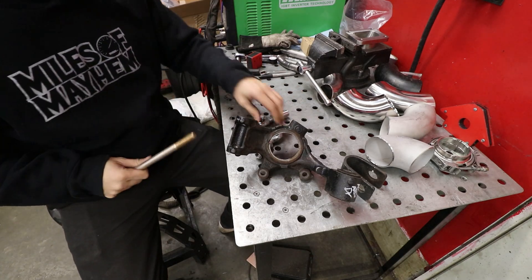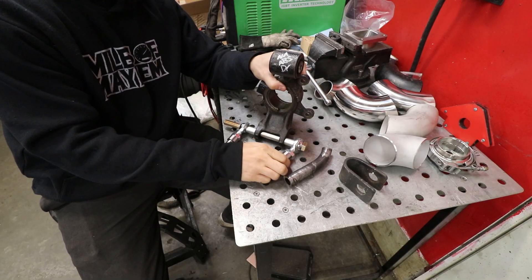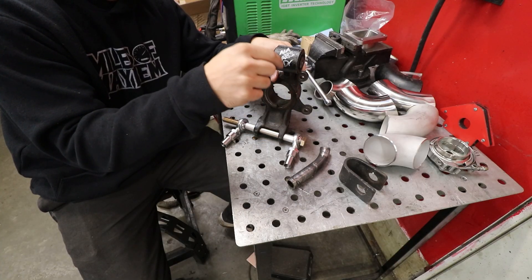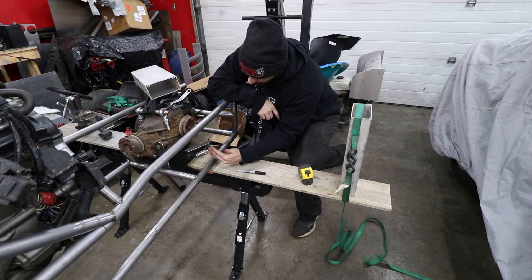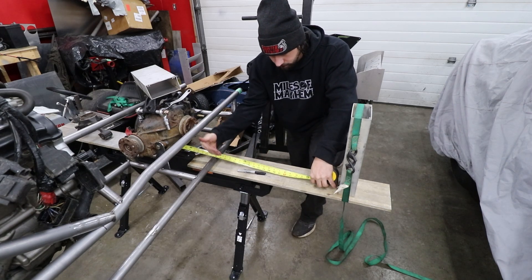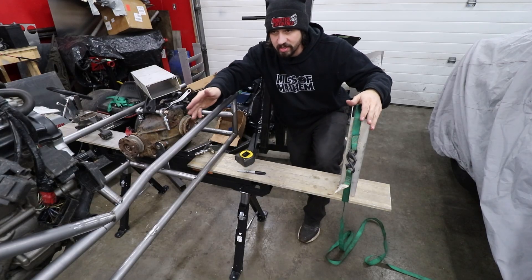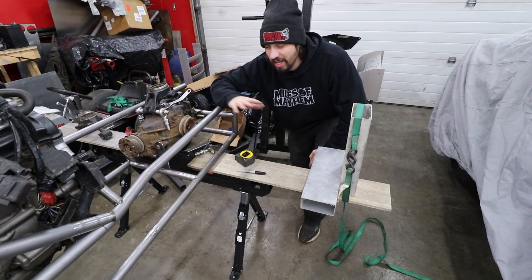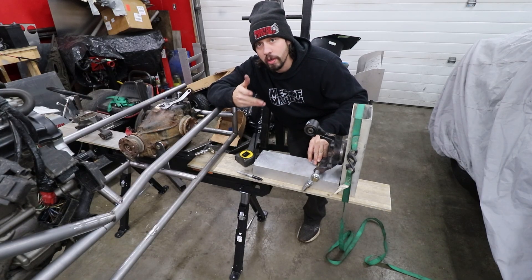Don't mind the mess — this is my plan. I'm gonna take two on the bottom here. These little spacers are just gonna give it more range of motion that we can use. The top one we're just gonna build a little plate to come out and then weld our two arms to that top plate. This might be a very unorthodox method but it's the best I can come up with. I drew a mark where basically the center line of the diff is on both sides, used a tape measure to make an imaginary line parallel with the front. So this is square with where the front of the chassis is supposed to be, and it's out far enough where the wheelbase is going to be roughly 72 inches. I'm gonna put this one underneath to give us about three inches of ground clearance on the chassis, and that's how I'm gonna build my arms on both sides for the lower part.